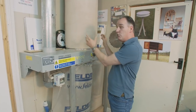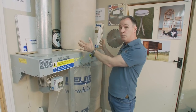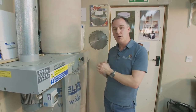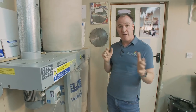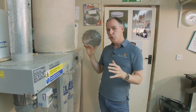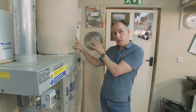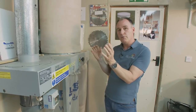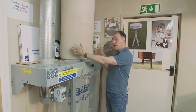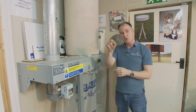That's good news — it's done exactly as I was expecting. This bag obviously will begin to deteriorate again as it gets more and more clogged up. For you, you don't have to have a dial indicator — just only use one open gate, knock down your bags on quite a regular basis, and look at probably changing them every one to three years depending on how much timber you're putting through. Also, if I was cutting a lot of very fine MDF dust these bags would get clogged up quicker. As a general rule, if you're producing less than about 25% very fine MDF dust on a table saw this style of bag is acceptable. If 50% or more of your cutting is fine MDF dust, this style of bag is not going to be suitable and we need to replace it with more of a filter cartridge bag.